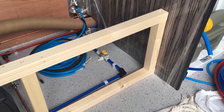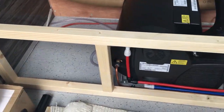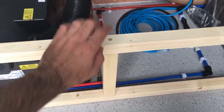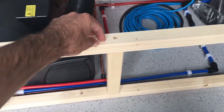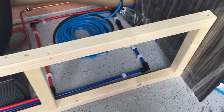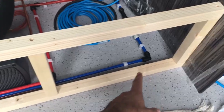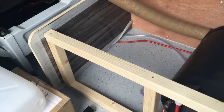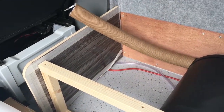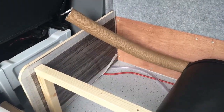So there's the first bit of framework for the front of the bench seat. You can see I've got those vertical uprights with the horizontal member resting on top — all the weight transfers down those legs into the sole plate. This is going to be fixed into the shower partition and also into the floor. We have another small partition on that side which just frames in the end of the seat — I've got a temporary board in there at the moment but it'll be a proper board similar to that.